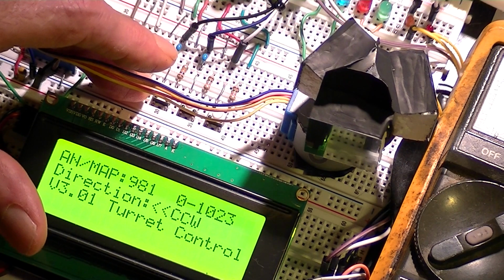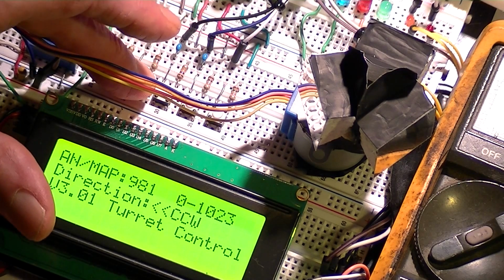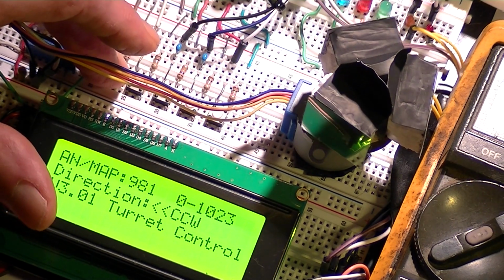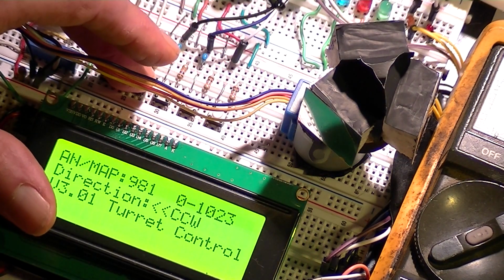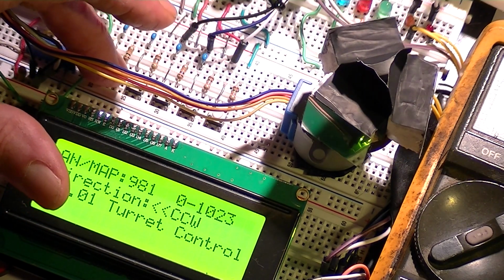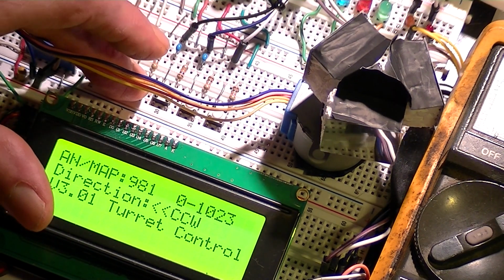As the light or laser beam enters the entrance slit and hits the first mirror, I can adjust this rotating turret to choose the wavelength range within the spectrometer itself automatically. And since this is a representation of 3 different diffraction gratings, these would be holographic diffraction gratings of different line resolutions, and I could choose whichever one that I want. And this stop and go function is extremely useful for choosing wavelength range.